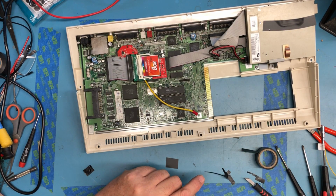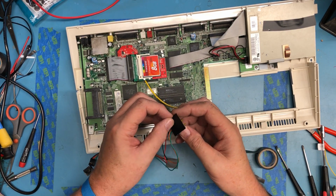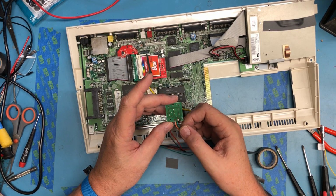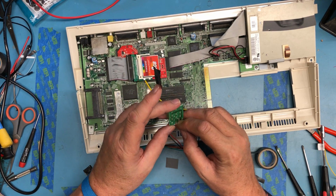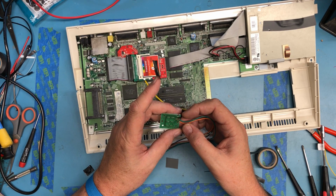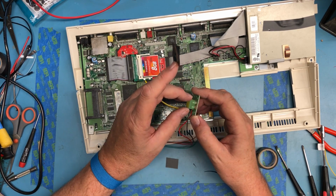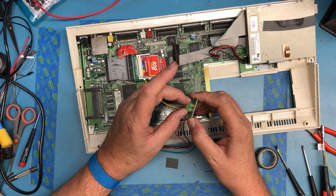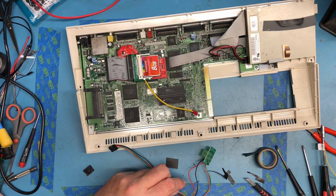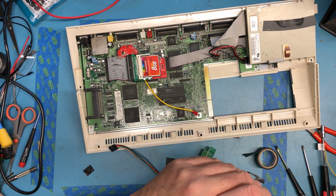We're really down to this cable, which is really, man, somebody has made a mess on the backside here. They've resoldered a couple of the leads. The green LED seems to cut in and out when I rock it, so I'm going to retouch the solder joints underneath that. So let me get the tip changed out on the soldering pencil.